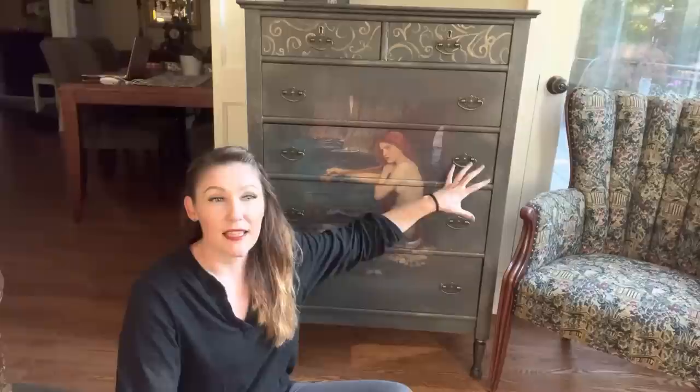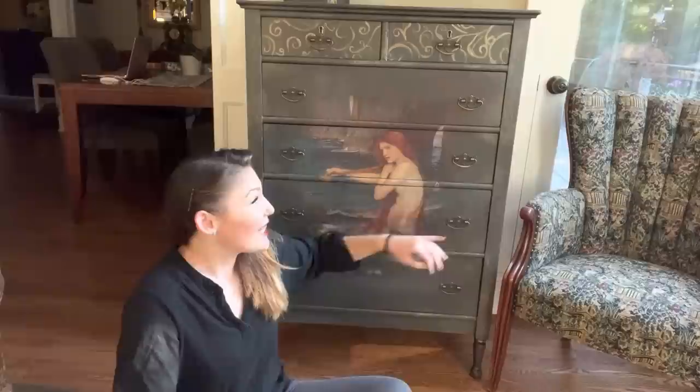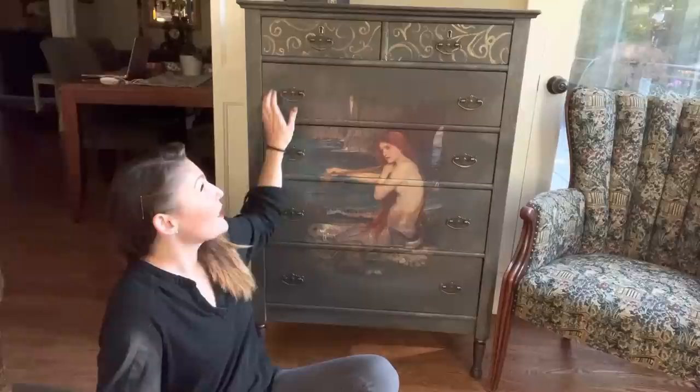So I'm like, okay, I like to work with pieces when they do stuff like that, and that's why I went for this finish. Of course I gave it the scuff sand and did all the things for prep wise, but I knew that as soon as I hit this with my water-based products, it was gonna start kind of activating the finish again and doing kind of cool stuff. So what I did to add to that is, you saw me add the baking soda to the paint. I did that as the base layer, and then I did it in the really soft blue for when it peeked through, you'd be able to see that, and it gave it more texture. So I've got that texture going on, quite a bit of crackling from the original finish, all kinds of stuff going on.